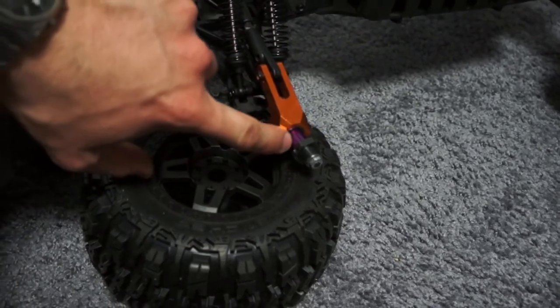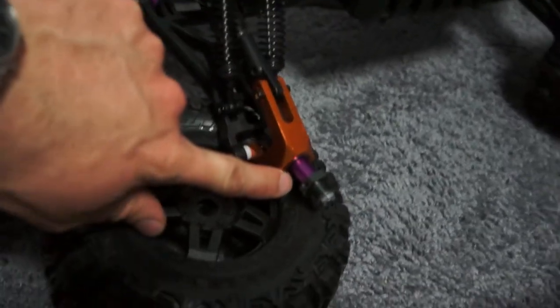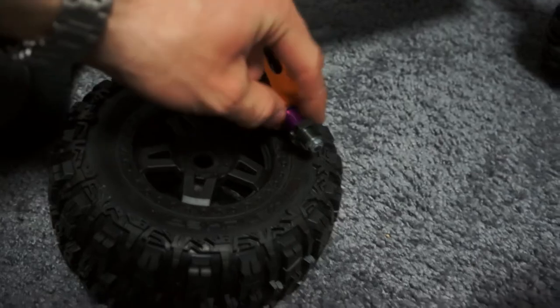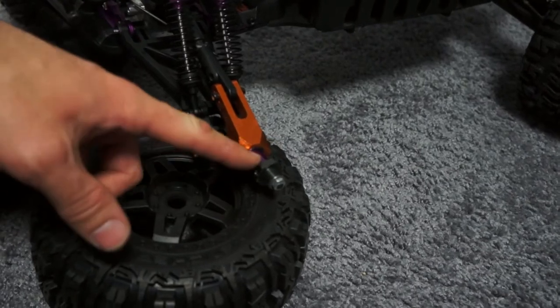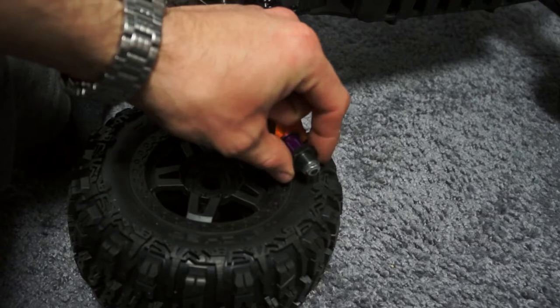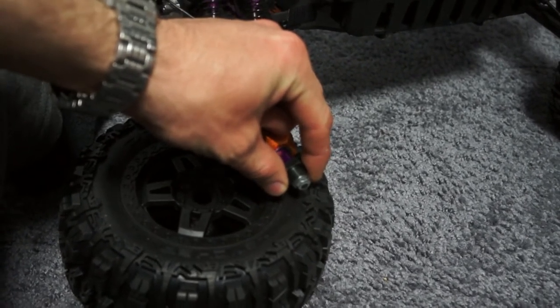But the important thing is to trim the spacer to exactly 13.5mm, and this is what I remember. So trim it, and it should be very precise. I did it exactly so it moves, it doesn't create any additional friction, but I don't have much play at all, just very little play.